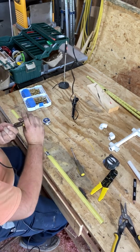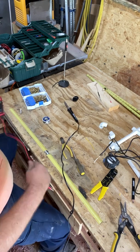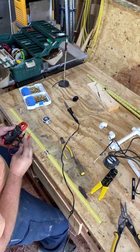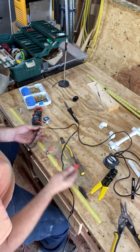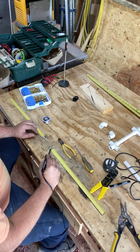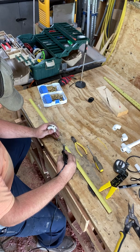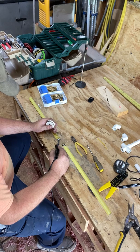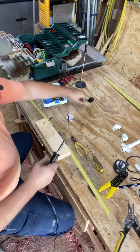Very carefully, not to cut the braid. We're going to flip it over the hose clamp and get it to the center. Then we've got the center conductor. I'm just going to put that over here. I'll be heating this up real good — let it sit there for a minute. Make sure it's not a cold joint, so everything solders up real nice. You want enough solder to make it stick. Take this wire out and lay it over to cool, then put our coax in.